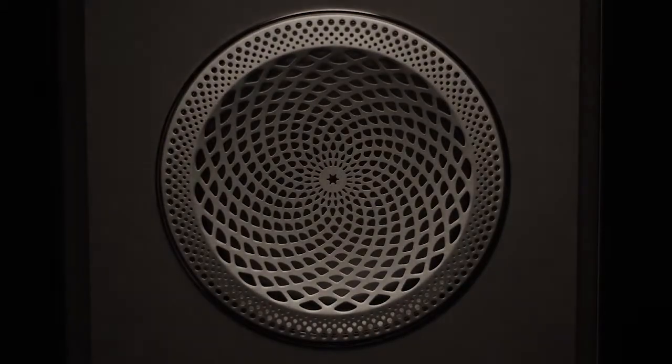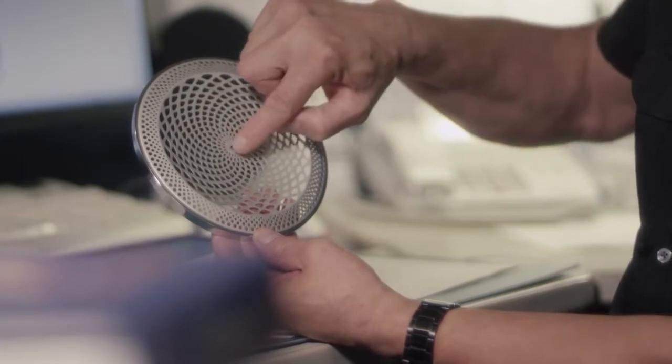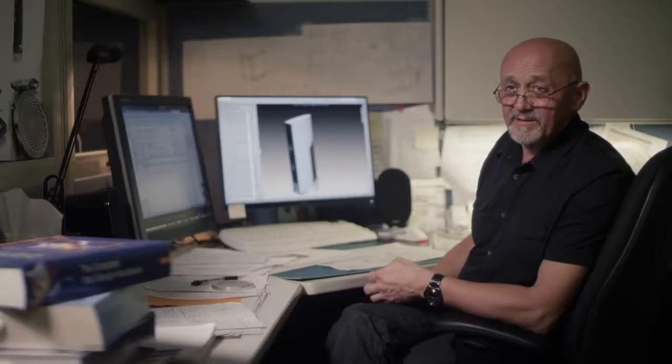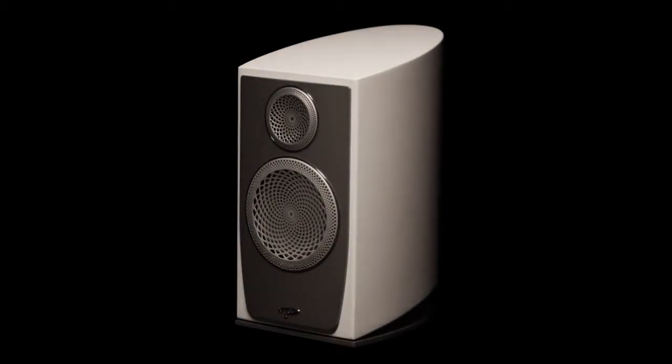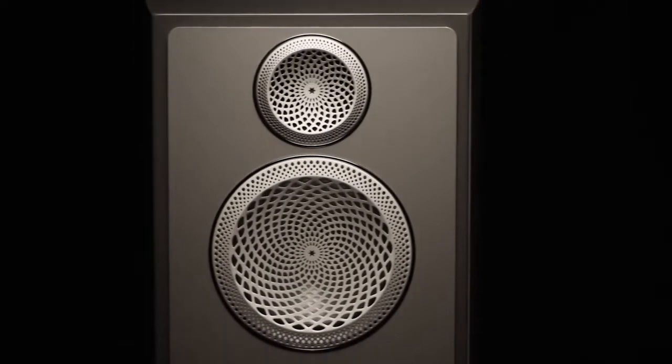The first thing you'll see when you look at the Persona are the grills that cover the mid-range and the tweeter. We knew we wanted perforated metal, and we ended up with something that looks less industrial and a little bit more organic — it gives us the feeling of a flow of motion. It is an important piece of jewelry, really adding great value to our speakers. But these aren't just grills — these are perforated phase alignment lenses. What these grills actually do is improve the performance of the drivers. Perforated phase alignment, or PPA, cancels out out-of-phase sounds that are radiated by different areas of the cone, allowing us to smooth out and widen the dispersion of the sound.